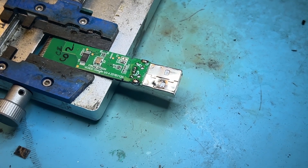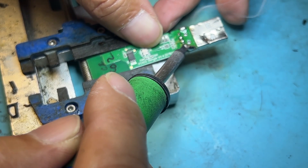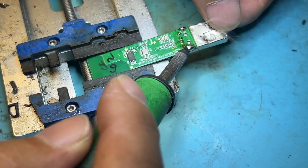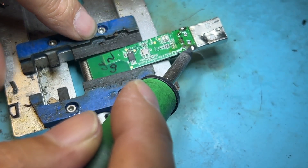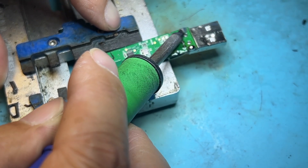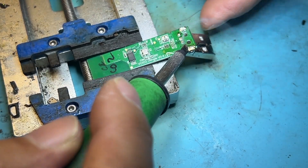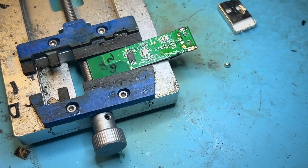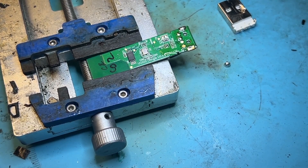You can see it's kind of liquidy there, and if you wait too long it just hardens again. But if you continuously apply some heat, it just loses the hardness and pops right off — that's the way to do it. I'm just keeping on applying the heat and I can feel it's moving. You can see the part is moving off already, it's kind of wiggling. It just comes right off. So I'm not breaking any pad or damaging the board. That's how I get the USB port off.